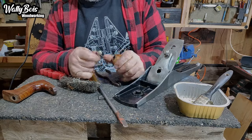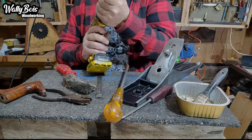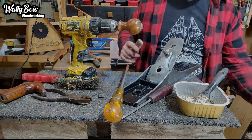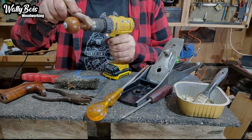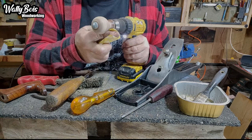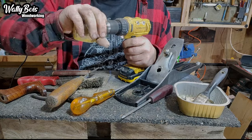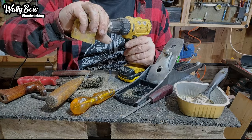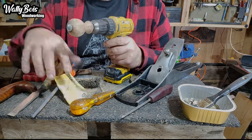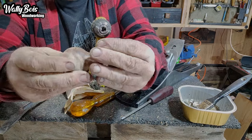It's time to install the knob — we need to remove the syrupy varnish from it. What I've done is put a bolt through the knob, through the eye of the knob, and placed it in the drill. I was going to use the lathe to spin it up, but not everyone has a lathe, so you can use a drill by putting a bolt right through the knob and into the drill. Then we just sand off the old varnish.